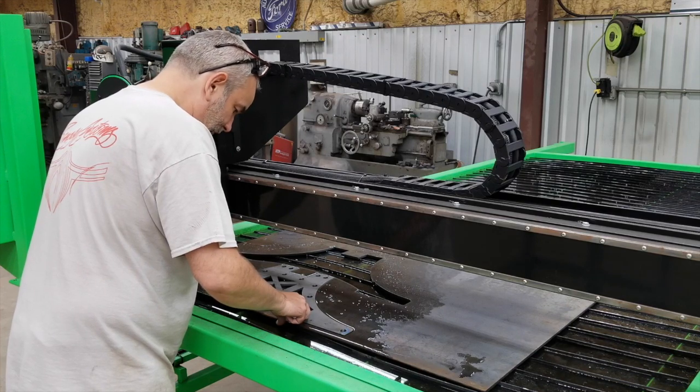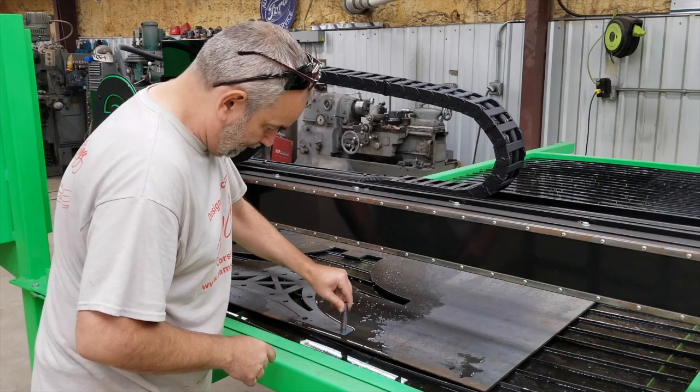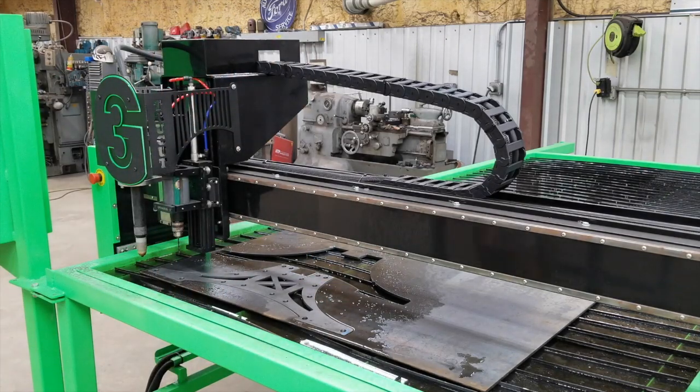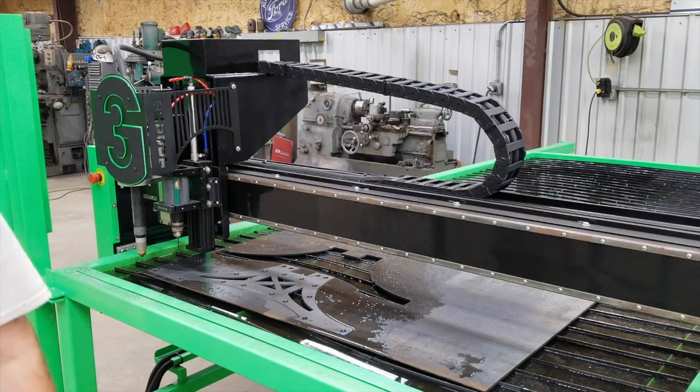I don't think it's going to matter a lot because of the way this fits up, but I'll try to get it centered. Just to confirm - see, that's not going in there - so I think we're all set. We're just going to hit cycle start. One thing we have to do is slide a piece of metal underneath there so we can let it reference off of that when it goes down. We'll yank it back out, but you've got to be fast on this machine - it does not play around when it comes to referencing.